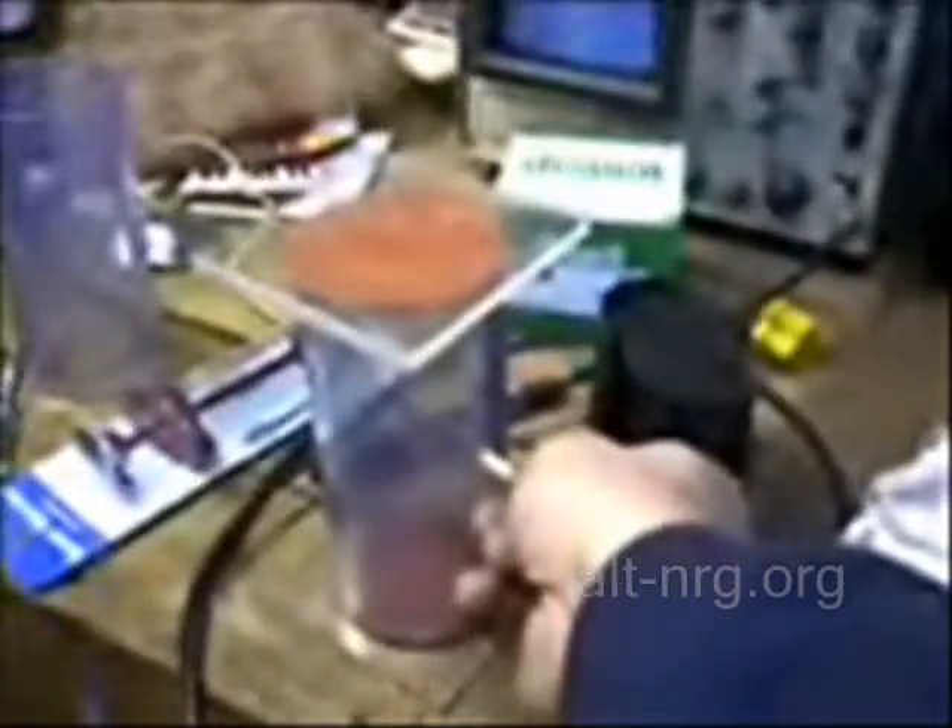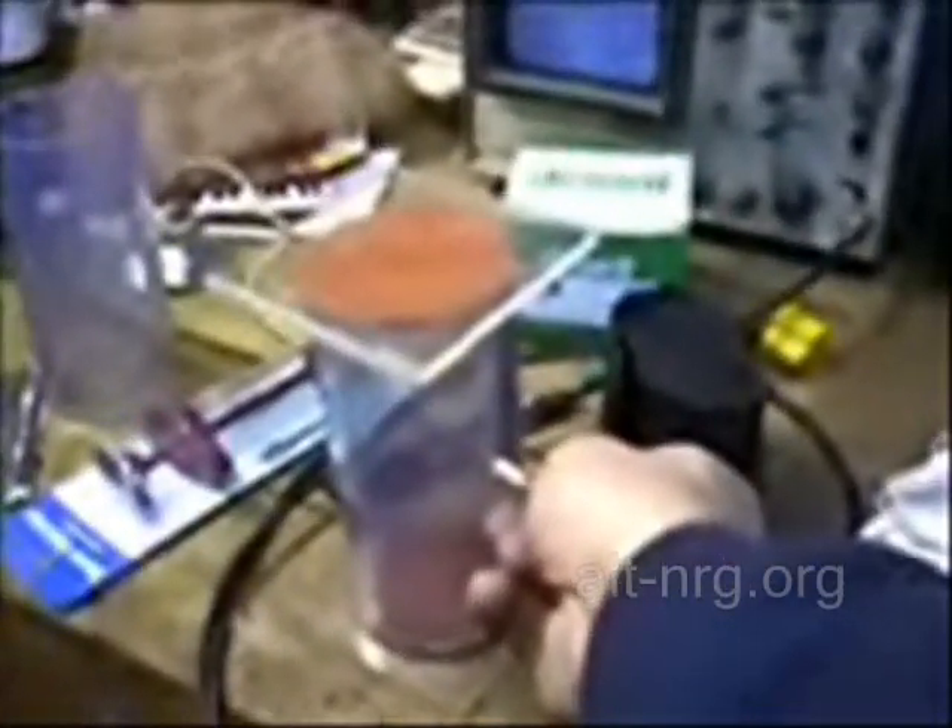This right here is the containment vessel for the plasma generator. And right here is a little ceramic bead that I bought off eBay with a small hole in the middle. This will go into the side and I will feed my high voltage through an electrode in the middle of that and put a piece of stainless steel screen around the back of the tube. This tube will be closed off and sealed with neoprene gaskets and a couple of end plates and some threaded metal rod fastened through holes drilled through the corners of the end plates.